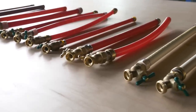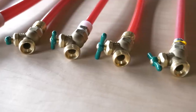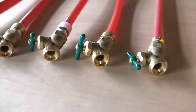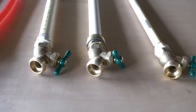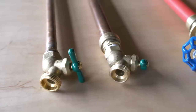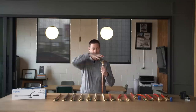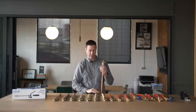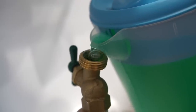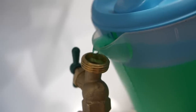So here's what we're going to do with this test. I've got half-inch and three-quarter pipes in all the major styles: copper, CPVC, and two different types of PEX, and we're going to fill these to the top with water. I chose a hose bib for two reasons: I'm curious to see how it does, and also I couldn't cap both ends of the copper — the pipe needs to be empty to sweat on a fitting. So we sweated on a male fitting on top, with a female hose bib that comes on, so I can fill this with colored water all the way to the top of the fitting, close off that gate valve, and know the water fills the entire 16-inch pipe.